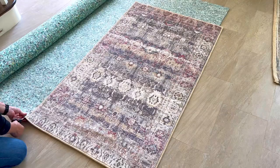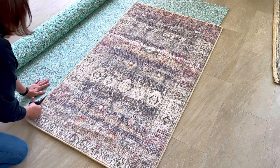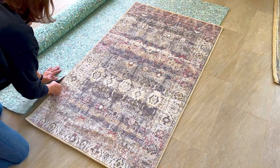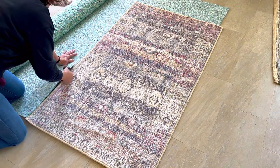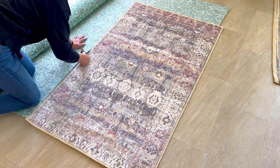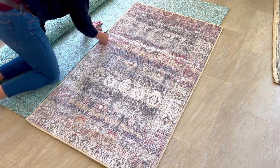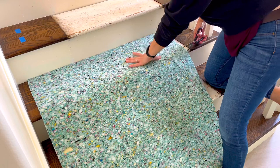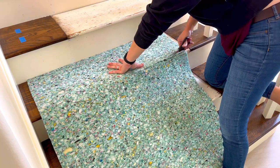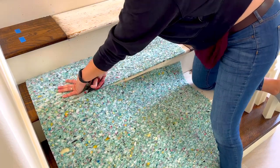Here I'm hanging my rug runner about an inch off the side of the carpet pad so I can cut along the edge and make sure the carpet pad is about an inch less wide than my rug — it looks really nice if it's slightly smaller and not showing. Tip number four is to cut that carpet pad so that it ends about where the curve in the front of your step is. That'll give it the perfect rounded edge on your steps without any weird lumps.